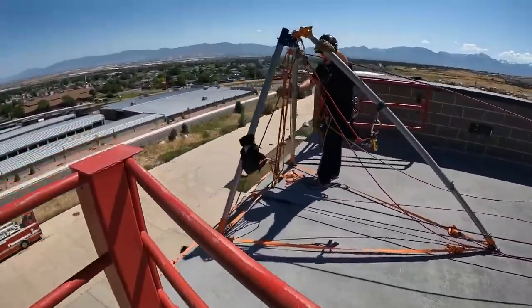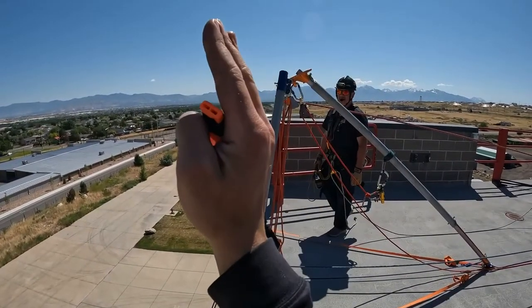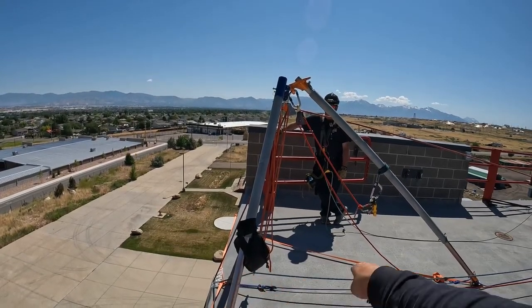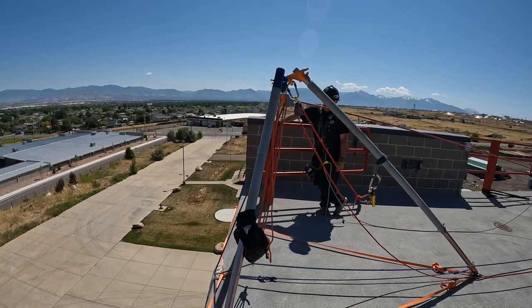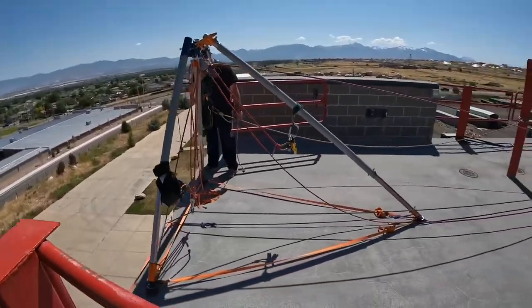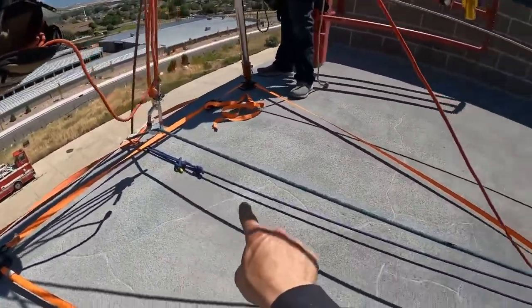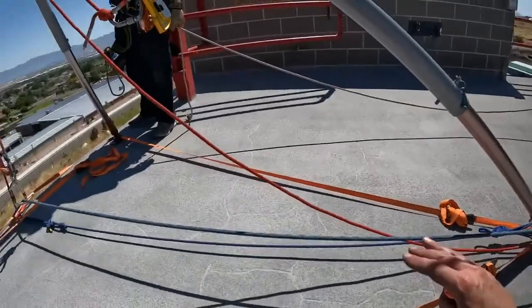Let's take a look at the frame itself. If you look at the feet and the angle — our head and our legs, everything's kind of pitched back just a little bit. Ideally you'd want this head to be at the edge or maybe slightly pitched forward — that'll clear the abrasion on the rope. The only problem with that is you have a tendency to kick these feet out. When you do it this way, it's a little more inherently stable, and it makes lashing and securing those feet a little bit easier. So our head's level, our speed is good, and our rescuer is going down to the ground to pick up the rescue package. We want to account for any thrust forces kicking our easel leg back — that's what this line right here does for us. We just tied it to the bolt at the edge, and then to the leg right here, and that'll keep that leg from being thrust to the back.